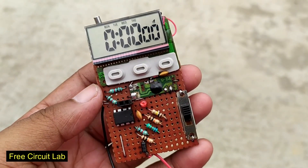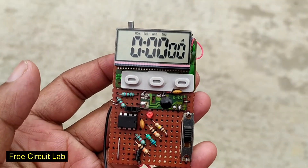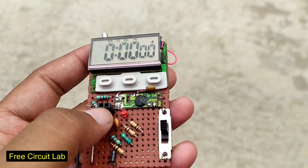The idea is pretty similar. Instead of charging it once, we will charge and discharge it continuously and measure the time to complete a fixed number of charging cycles. So we have to use a stable, free-running oscillator circuit instead of a single-shot or monostable circuit.